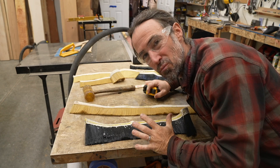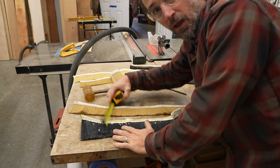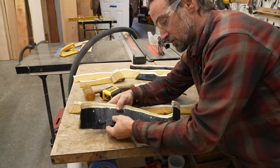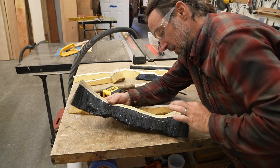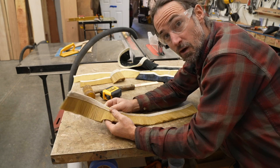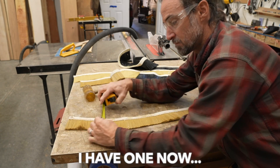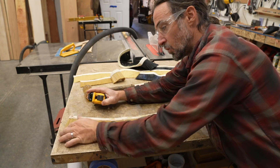Let me talk about some of the brushes I've been testing. The first brush is a three inch long brush — I liked it because it could handle up to three inch depth cuts. Some of the problems were that it started to push in and was getting chewed away by the CNC, and worse, for tool changes the bristles would stick out and get stuck in the spindle during a change. A shorter, softer brush solves the problem of getting stuck in the ATC — the bristles fall back a lot easier. The disadvantage is I haven't been able to find a longer one; this is just two and an eighth inches. But I do like it, so I pulled it off my old dust boot and I'm going to use it again.